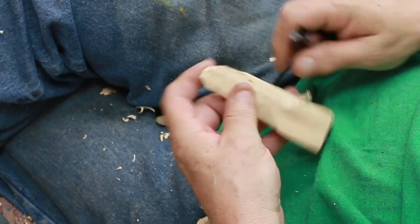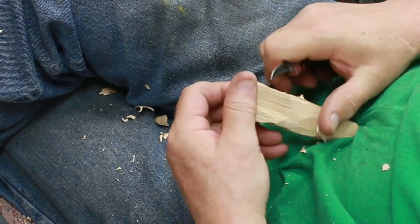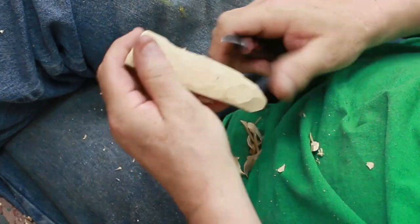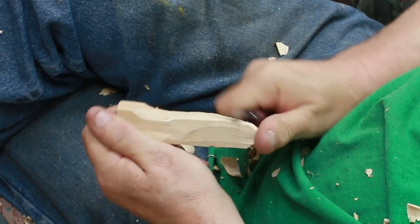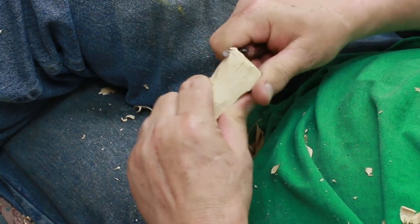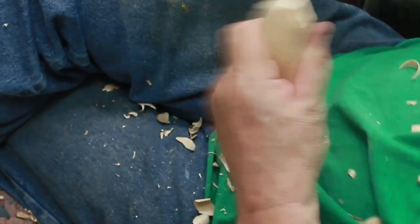That set may work if you have all the stuff to sharpen it. So taking the scenario that I gave you, you're stuck somewhere for a week or two where you don't have access to your carving tools, you didn't bring them, and you thought you wanted to carve something. So you went down and picked up this set. Well, in addition to picking up this set, you'd have to find some stuff to sharpen it. And that gouge, you're not gonna get the job done sharpening it by just having a whetstone in front of you. You're gonna have to have at a minimum a slip stone that you can get the inside of that gouge, and then you're gonna have to have something that you can strop on that also. So taking the basic shape down,